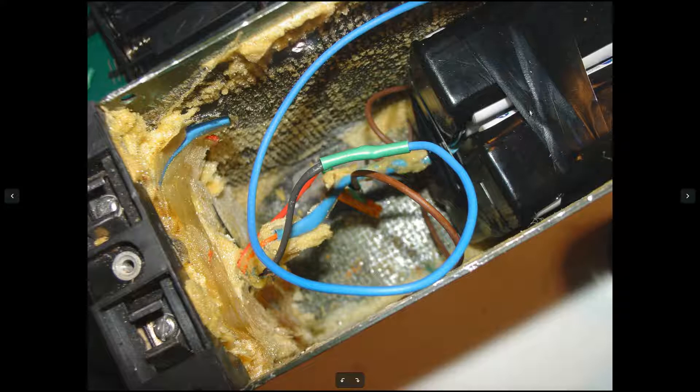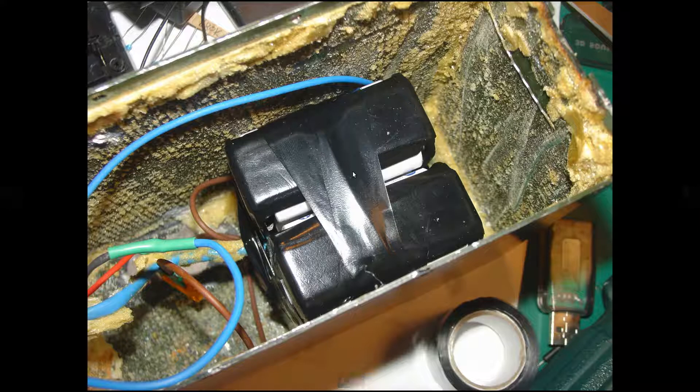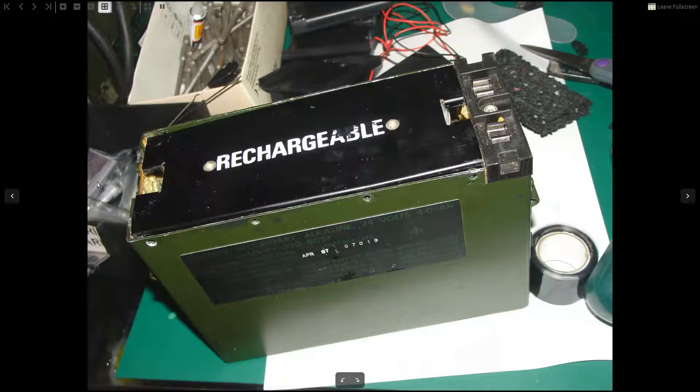I also tested this on nickel-metal-hydride Eneloop cells, and it works fine on the original DCCU charger — I tested this on the real military unit. The output voltage is about 30 volts and it charges them fully with no problem. The cells start to warm up, the DCCU shows a green LED detecting full charge and cuts off the charging voltage. When the cells cool down, the temp sensor detects the difference and restarts charging, so they maintain a full top charge. I did several charge cycles and measured the capacity — the real DCCU has no problem charging Eneloop nickel-metal-hydride cells.